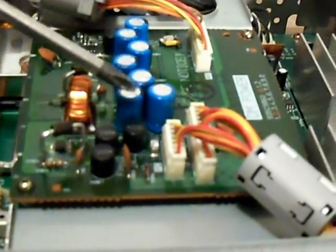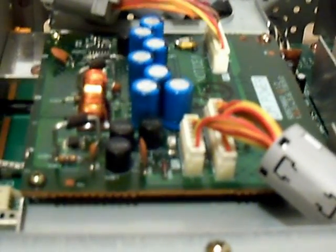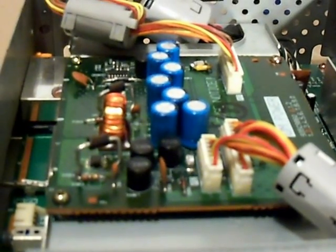This is a WS65869 — that's the model number of the TV — and this is the DM board assembly. Now popping the hood on this thing with the screws removed and orientating the board around, right away we can see there are one, two, three, four, five, six, seven capacitors — electrolytic capacitors — and that's more than likely what's causing this problem.